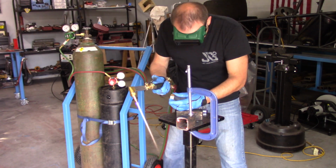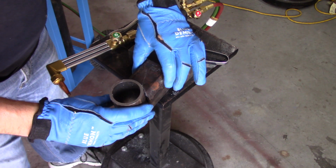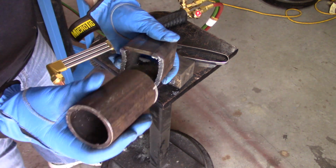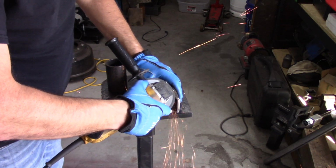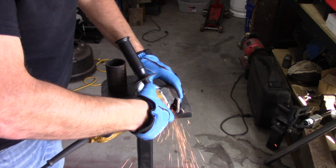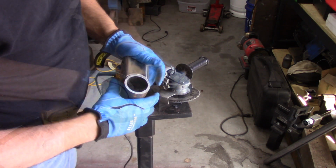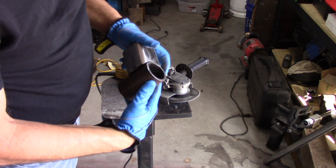But I did get both sides cut pretty good, actually. Once I got it cleaned up, it was notched pretty well. Probably a lot better than I could have even done with a hole saw. A hole saw would have taken forever to go through that thick metal. Definitely oxygen cutting was the way to go. But after I cleaned all this up, it fit together real well.